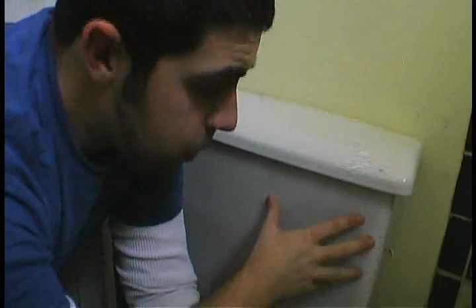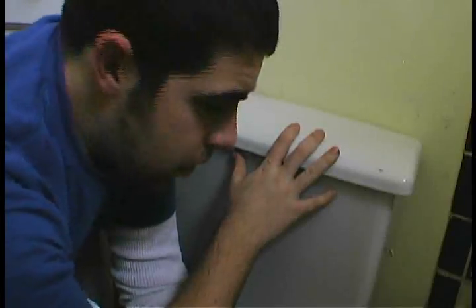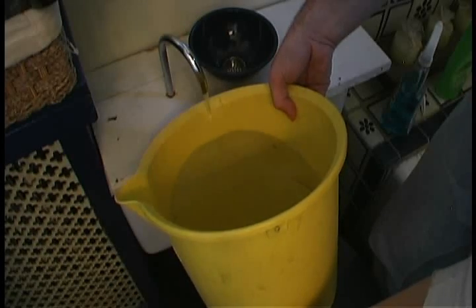So we're back in the bathroom and it's time to put it all together. I need to warn you about two simple things. First of all, when you put your bottles into your reservoir, you've got to make sure that they stay in place or they could cause a leak — I wound up using a hanger and some rubber bands. Second, when you build your sink, you've got to make sure that all of the water runs down into the reservoir. The water will only turn off when the reservoir fills up, and you could flood your whole house if you get that wrong.